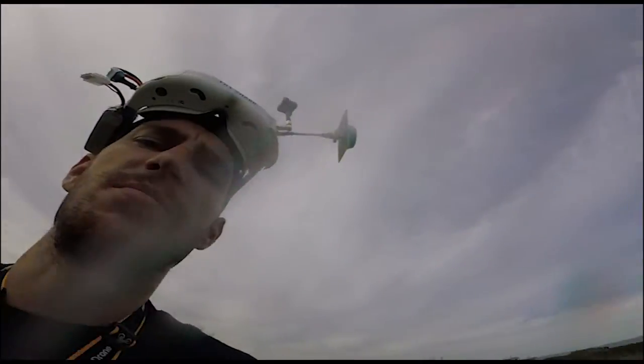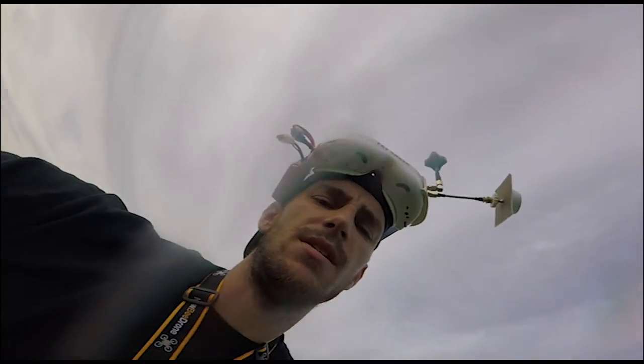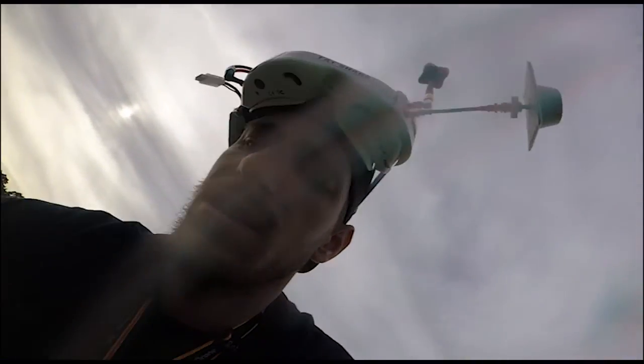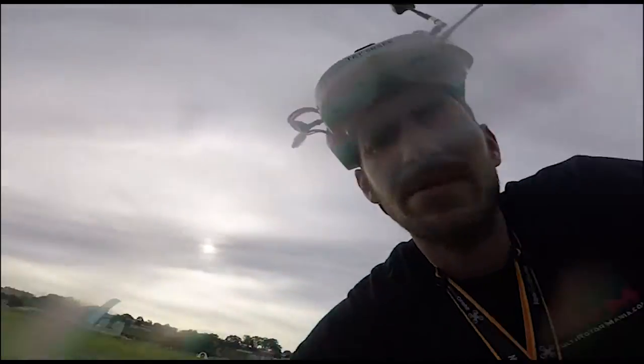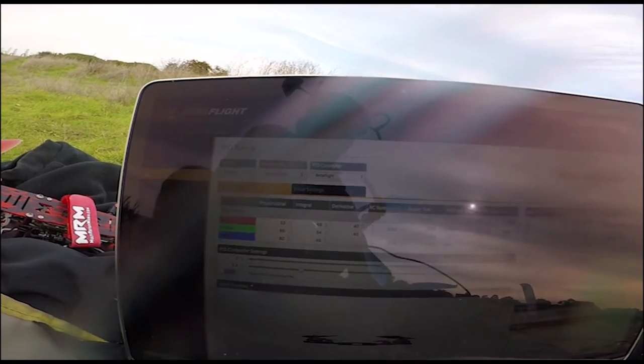So that was in the right direction. We moved yaw P down just a touch, and we bumped up the roll and pitch P. So let's go ahead and turn down yaw P a little bit more. Let's keep D the same. So we went down by one on roll, pitch and yaw.